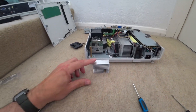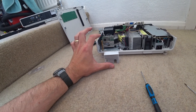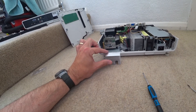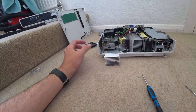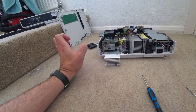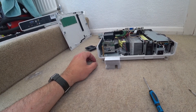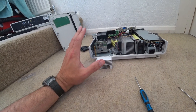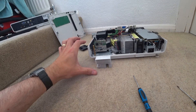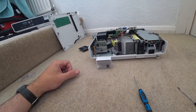There are just two screws holding the heat sink to the actual DMD, and this is probably the culprit: the paste may have deteriorated over time and wasn't cooling the chip sufficiently, which is why I'm beginning to see the mirrors being stuck and those pixels that are stuck on. Before I do any more on this machine, I'm going to get the second machine down to this same level, then I'll be ready to undo the necessary screws to swap them out.